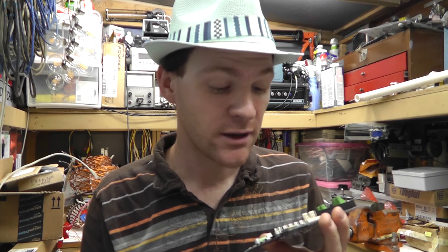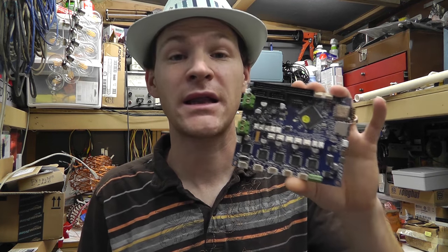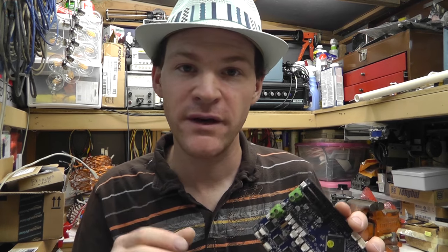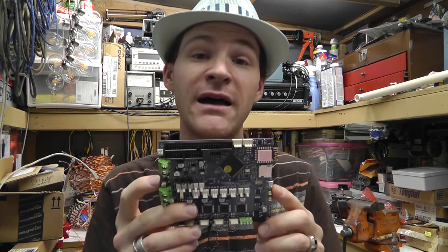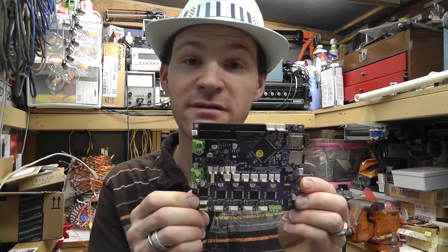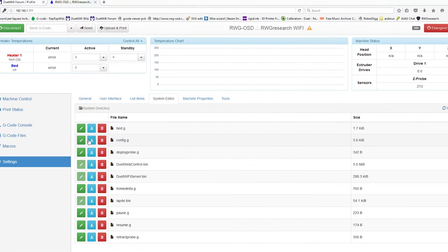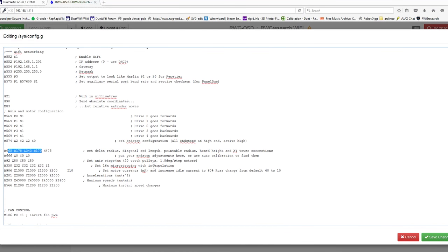The web interface, the touch screen, the ARM 32-bit processor — and for a Delta, you can run a RAMPS and run a Delta, I've been doing it for three and a half years, it works. But this is going to make life so much better. With the interface I've used on the Duet 0.8.5, I can tell you it's going to be life-changing for 3D printing. One of the things they fixed about the web server on this version: previously you could only edit the config.g file on the fly. Now you can pick any file on the SD card and edit it right there. Awesome.